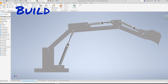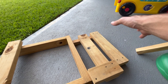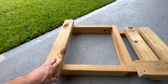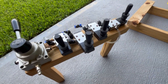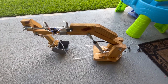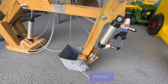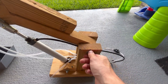At this point, I was ready to build. This is my base frame. Because the excavator will hang out over the front of the base, the weight will cause the frame to tip. This board acts as a counterweight to resist that. This is the control panel for all my pneumatic valves. And here is my main assembly — I've got the boom, boom cylinder, arm cylinder, arm, bucket, cylinder, and the swivel cylinder. And I use bolts for the pin joints.